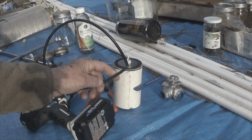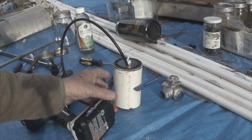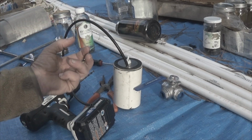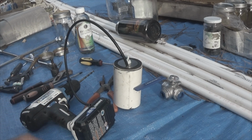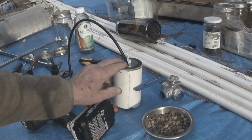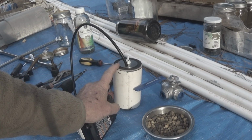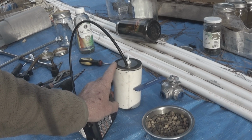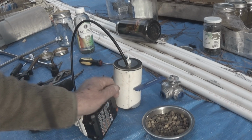and I'll be able to feed air through this line down inside here and blow the water out of the casing and most of the drilling fluid up through the bore alongside the casing and then out where it can be pumped off somewhere, and we won't worry about what the bentonite clay is doing. I'm real happy with this. I had several different options that I was going to explore for this. This has proven to be the best, and I have no complaints.